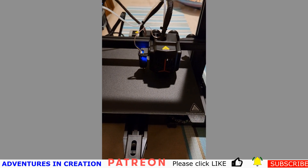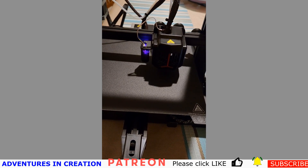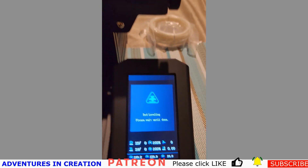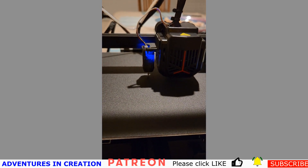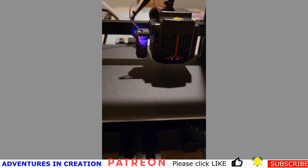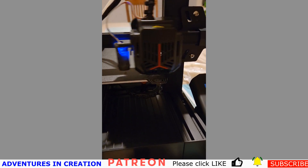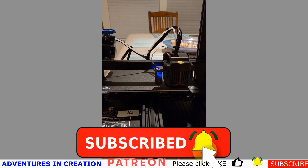The auto leveling you'd think would make this easy, but I found my first layer adhesion was awful. I tried to print the rabbit that came with it — just printed what they had on the SD card — and the first layer did not adhere at all. It wasn't stuck to the surface and just kept moving around. So after a few adjustments I thought maybe the rabbit's not the one to print and ended up printing the boat — essentially a benchy — that also came with it.